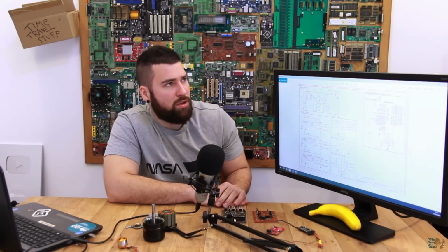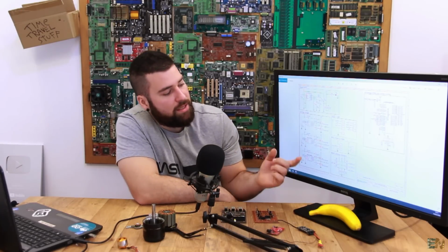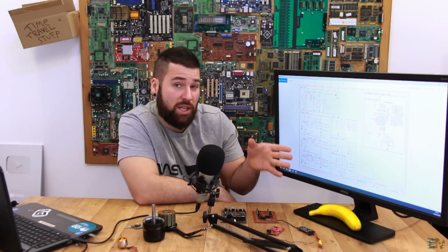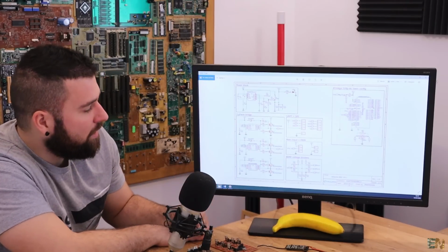And also with maybe using the LM317, that will be a good option. You can get very steady voltage for the drivers and the MOSFET. Or maybe instead of using drivers you can use directly a BJT connected to the main voltage, but that will change a little bit the schematic.